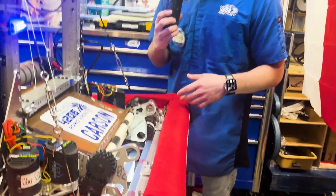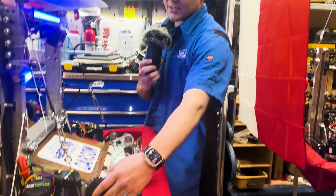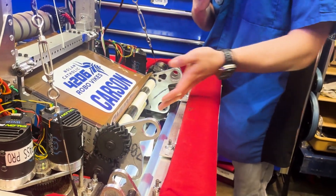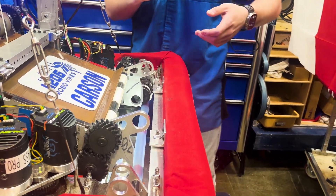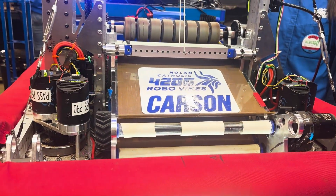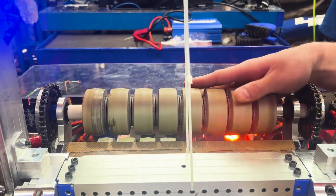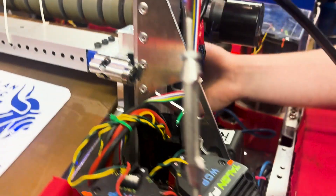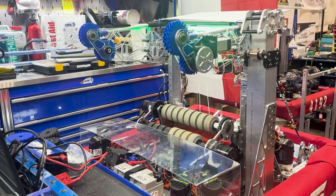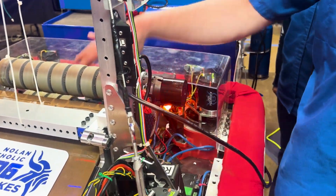The shooter mechanism is completely separate from our intake mechanism. We have another Vortex motor on a five-to-one gearbox driving these two custom 3D printed gears right here, so they spin opposite to each other — we call it the conveyor. The note passes through the intake, hands off to the conveyor, then feeds into our shooter wheels up here. We have two-inch and two-and-a-half-inch Colson shooter wheels, and the lower bar rotates to flip up and down so we can shoot from different distances. We intentionally put two different sized wheels on the bottom to get spin on the note, and these are independently driven by Vortex motors.